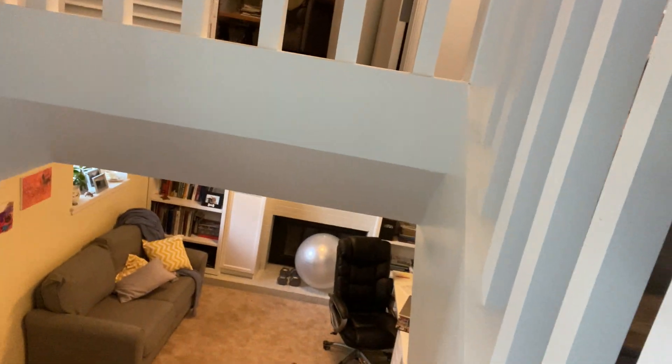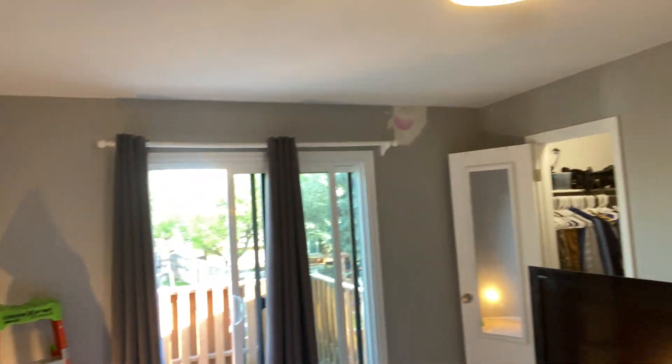Space heaters run 1500 watts at 12 and a half amps of consistent power. Slim Jim GEs have a hard time sensing that, and evidently it melted. I've had this with air conditioning units as well. We couldn't even get down there. All the way up, that wire back here had to be cut off and fed in through these closets. Once I back-fed it, it still tripped the breaker. I used my continuity meter — between black and white should never have continuity, like you would a baseboard heater. Basically, that wire became one continuous wire all the way through.